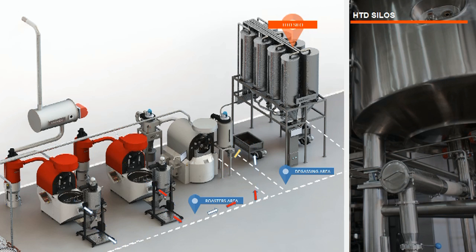Using Hardin's on-demand coffee silo, you can put the coffee for degassing before starting the next process. We have now installed three units of Hardin's coffee roasters with afterburner, equipped with bean loader and stoner, and installed Hardin's on-demand silo for storage and degassing coffee after the roasting process.